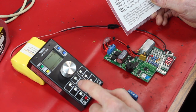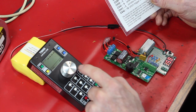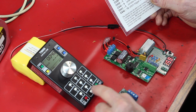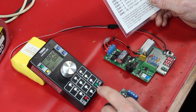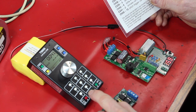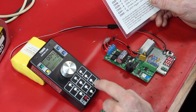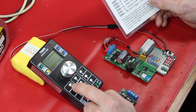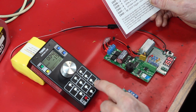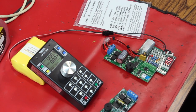Okay, so then 38 becomes 4, 39 becomes 5, 40 becomes 6, 41, enter, 41, which is F8, or the F7 button, becomes the smoke switch. That's the value of 2. And then CV42, the last one, we enter 15. That says trigger the ditch lights back and forth. Okay, I'm going to escape out of that. We're back to controlling. And now we're ready to test.